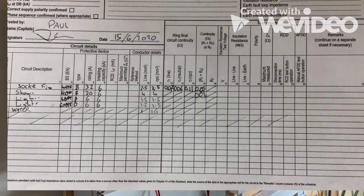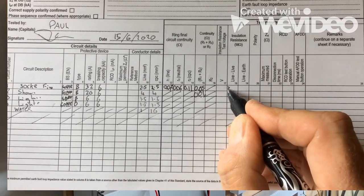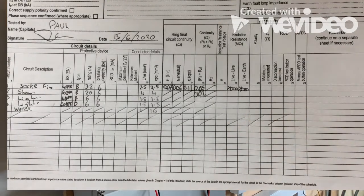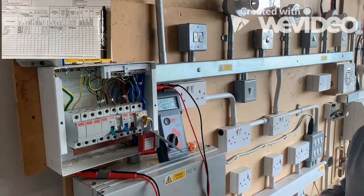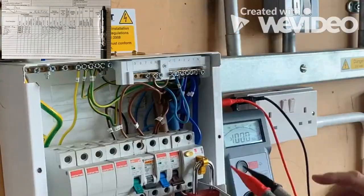So we're just going to write that down on the sheet where it says our ring: greater than one thousand. It's already in megaohms so we don't need to write that. I'll rewrite this test sheet a little clearer later, but for now we've got over a thousand recorded.